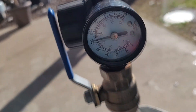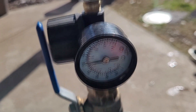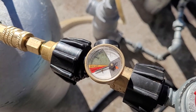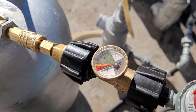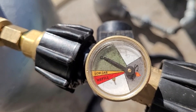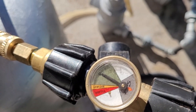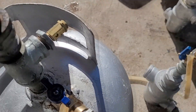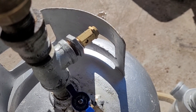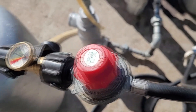We hit 100 psi. I have this propane tank valve that tells you how much gas is left, and despite being at 100 psi it's still reading below a fully compressed propane tank's range. A regular propane tank usually goes up to 145 psi, but the spring in my pressure release valve only handles about 100 psi, so I can't push it much further.